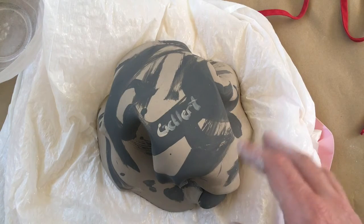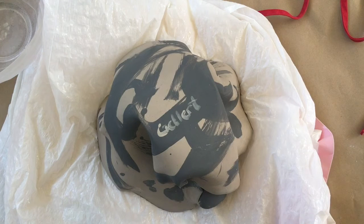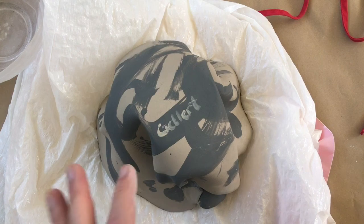I'm just going to let it dry. I can let this dry pretty quickly — I'm going to leave it uncovered and it should be just fine. As far as this joint goes, I might want to consider covering this section where I put the little patch with a small piece of plastic, so that it dries a little bit slower, because it is a slightly different moisture content and maybe prone to splitting.